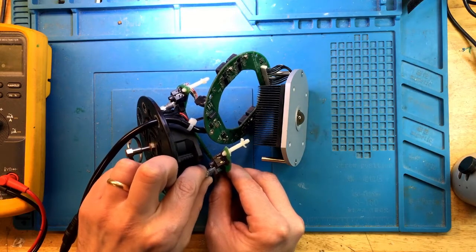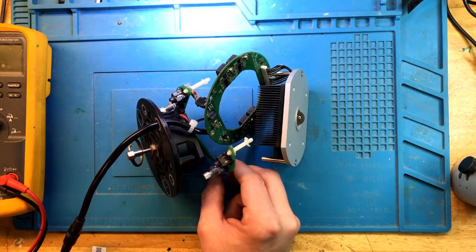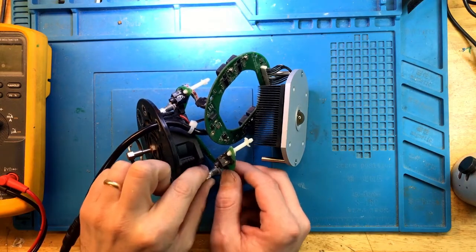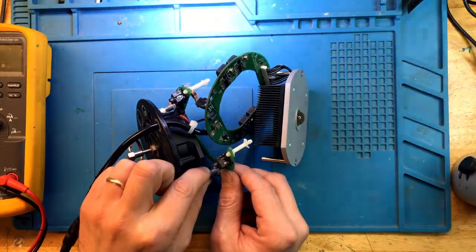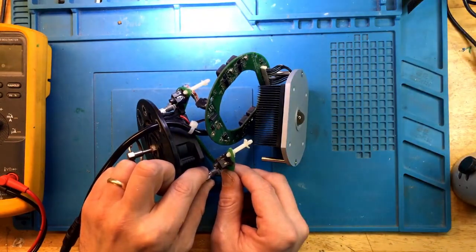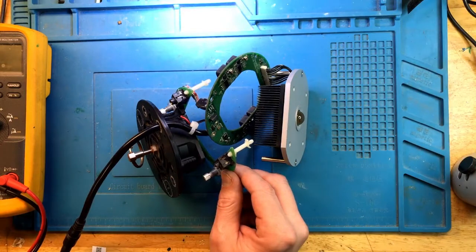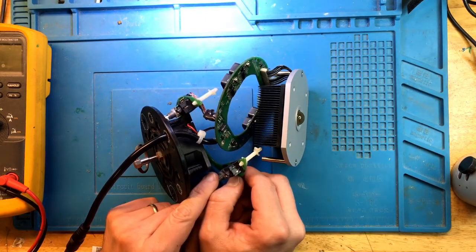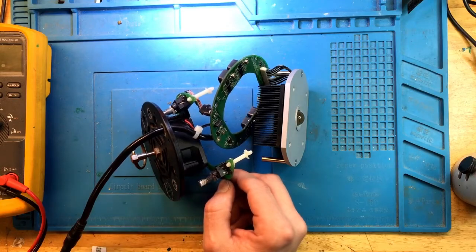Okay, the light is flashing. That's not a good sign, but that could be an indication that my current is too low. Let's increase the current a little, see if that helps. Yeah, it definitely shuts off and then goes into overdrive. All right, let's increase a little bit more current. And it looks like we still have a problem. All right, the short is back.